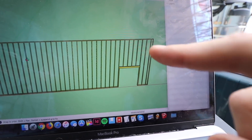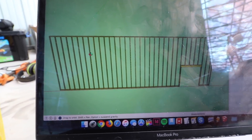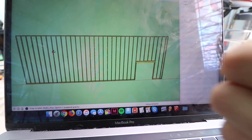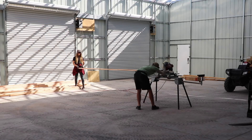With how the garage is constructed, we'll actually have to shorten the end stud and notch it over, then go up, and we'll have to do the same on the other side. That's the only difference you're going to see from the actual end product. But we've got that nice double door there — it's going to be sweet.